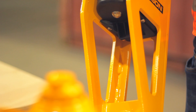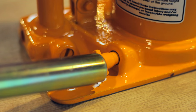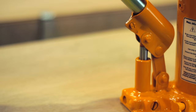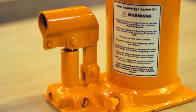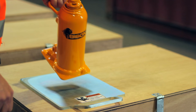The ball beneath the scale engages with the cup fitted to each bottle jack. To raise the bottle jack, tighten the valve and pump it with the handle supplied. Lower the jack by loosening the valve — don't loosen it too far or the oil may leak. Read the safety warnings on the jacks carefully before use. Use a ground plate beneath the bottle jacks to spread the load and protect the ground surface.